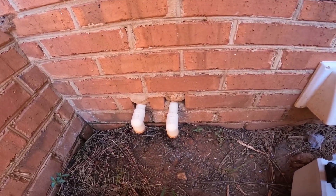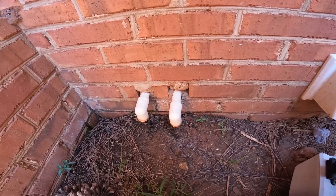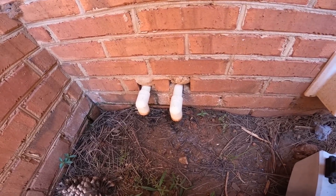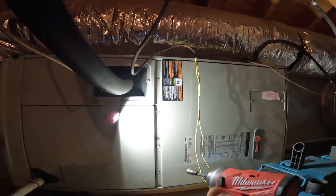I don't really think we have a clogged drain at this point. It may have been icing up. I've got to get the water out of the pan so I can check it. I'm likely going to have to do a leak search, so I'm going to go ahead and take some of these panels off and look inside the drain pan.